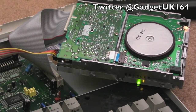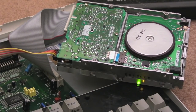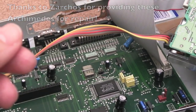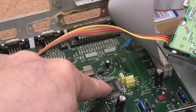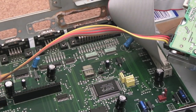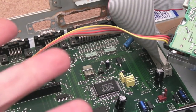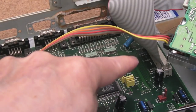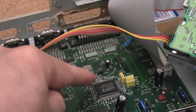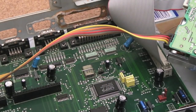Testing it with the proper cable, you can see the exact same thing going on - it's just flickering away, doing something with the floppy drive. My eyes are firmly on this. It could be one of these resistors - maybe a pull-up or pull-down - detecting some signal from the floppy drive when it shouldn't be, when the signal should be pulled low or pulled high, and it's stopping it from booting.